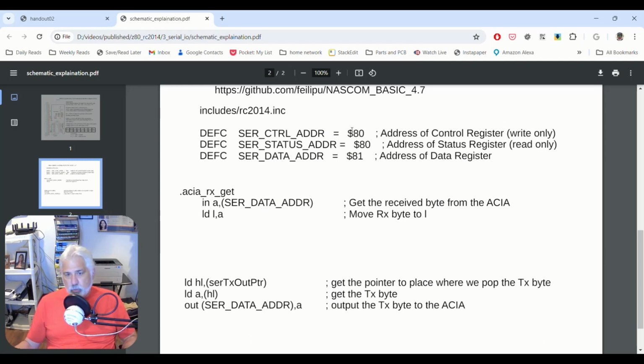And in fact, that's pretty much exactly what's going on. There's both some interrupts set, a loop going on, and it's processing all this data. We'll look at the basic code later for Microsoft Basic. But what we're trying to do is understand, how does this serial board work? And if you look, this is actually cut and pasted from the source code for that original version of Microsoft Basic that's been modified specifically because our computer, our RC2014 Classic II,